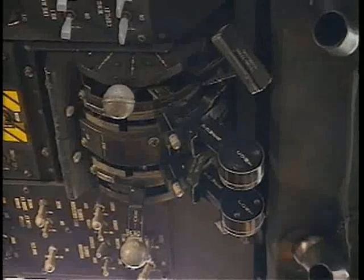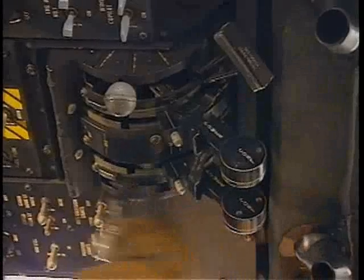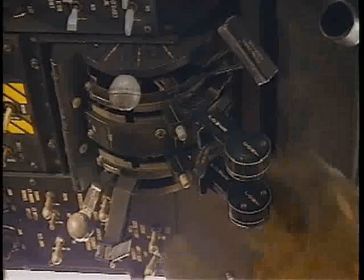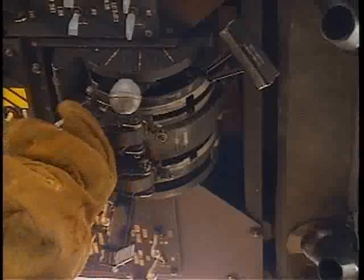An emergency shutdown is done in 3 steps. First, shut down the main engines. Locate the engine control quadrant on the forward overhead console. Pull the lever to the rear. A word of caution. This action might activate the fire bottles. To pull the 2 center levers, you must pull down slightly and push in on the latch release. If you're not sure the APU is off, pull down on the T-handle located just behind the engine condition levers.